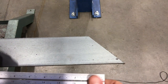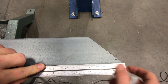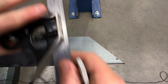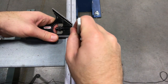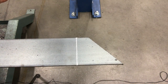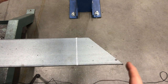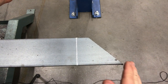What I'm going to do is take my square and come up here and measure from the very tippy edge to that four-inch mark, and then take my square and draw a line from one side to the other off that line. I could also put this thing in the bandsaw and measure from the blade to this tip over here — I'm actually going to do it that way so I can show you guys.